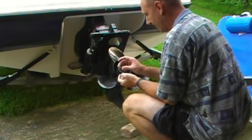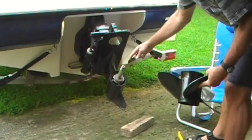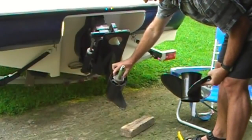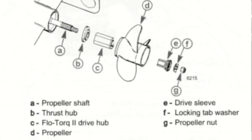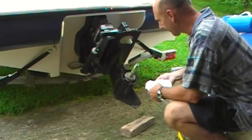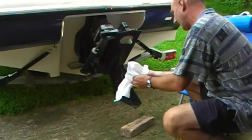There comes your tab washer right after. To get the prop off, get a grip on the blades and pull — it came off quite nicely. You can see some lube left on here, and here's my thrust washer which I shouldn't have to replace. This is a Flow Torque 2 system — you can see there's an inner device that slides into a plastic sleeve. Now before I put on the new prop, I'm going to clean off the prop shaft and all the splines and remove any gunk that might have accumulated.